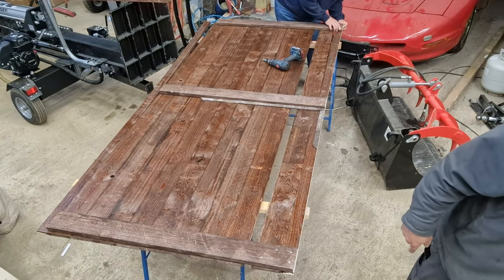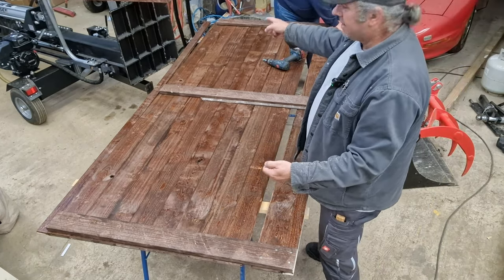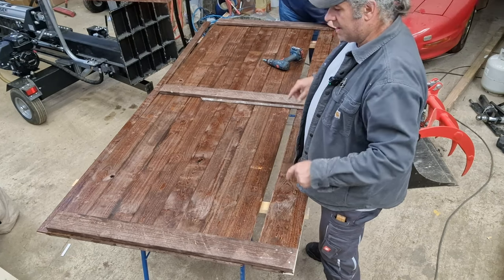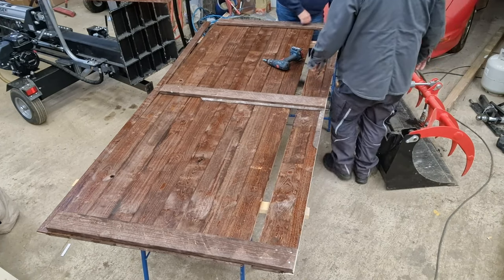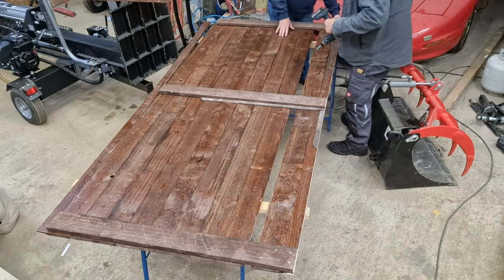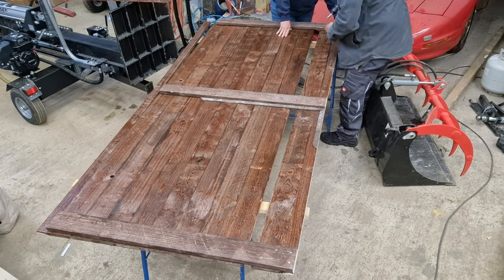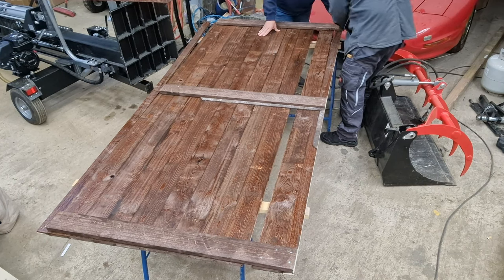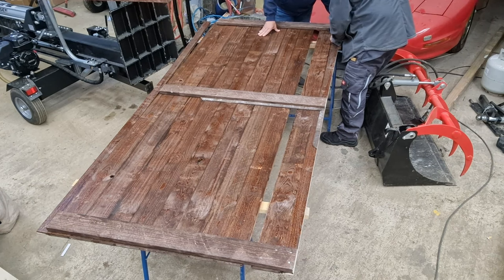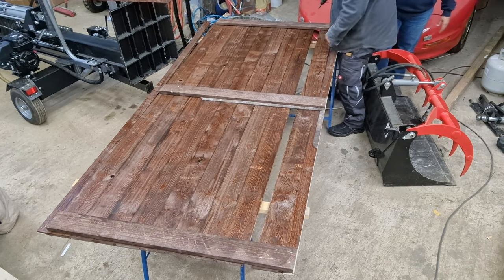Now, because all the others will be straight, what we're probably going to do is stack them all in. And we're going to pinch the door in and get the other end done so that everything is tight. And then we can just go through and hurry up and do all the screws. But we'll see. Do these two. So Rachel's making sure that it's even with the end grain here. And then I'm going to do two screws in here. And then we're going to squeeze this one in. So me and Rachel will switch places, of course.